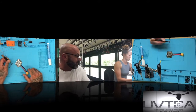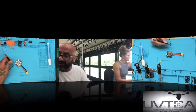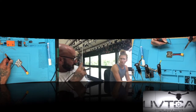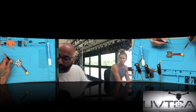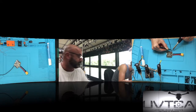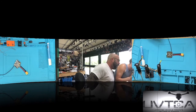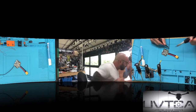Okay? So now, you're doing it left-handed. I'm going to do it right-handed. We're going to go to the outside pin. Clean off your soldering iron. And what you're going to do is not press too hard because you don't want to spread the wire out. The heat and the weight and a little bit of pressure will get this to go just fine. So just go ahead and do that. It should go on pretty easy. Don't tap it. Hold it and go. Uh-oh. I forgot to leave the wire. No, don't let go of the wire. No, grab that back. You can't do that. So, okay, heat it up and lift the wire back off.